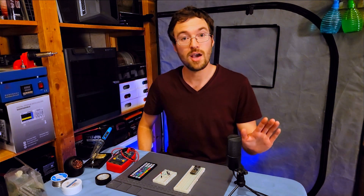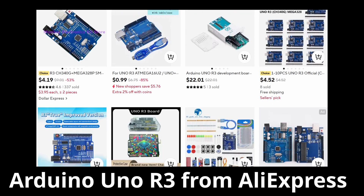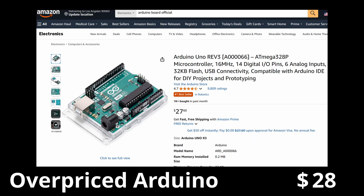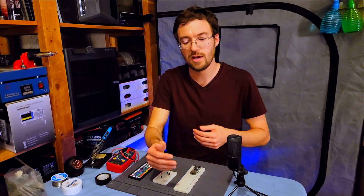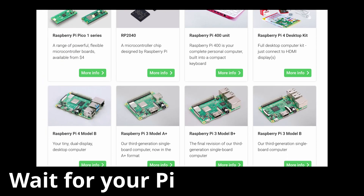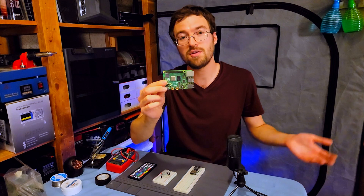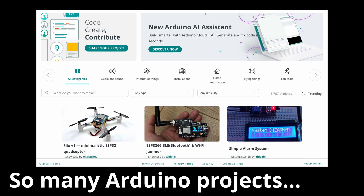So what kind of microcontroller should you get — an Arduino, an ESP32, a Raspberry Pi? Just forget all that noise and get yourself a cheap Arduino. You'll get to those other boards eventually, but get a $2 or $3 clone — not the original, get a clone — and start buying other boards as you go. They all pretty much work the same. Once you learn the basics with Arduino, maybe get an ESP32, and once you're comfortable with that, maybe a Raspberry Pi. But the problem is a Raspberry Pi is like a $50 board — when you accidentally connect things wrong and the magic smoke gets let out, you're out $50, you feel really bad, and now you're discouraged. First, if you broke a $3 board, who cares? Go get another one.